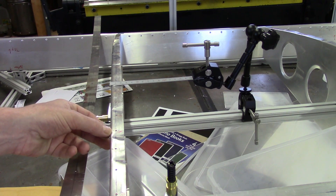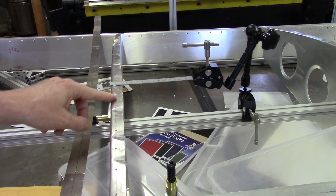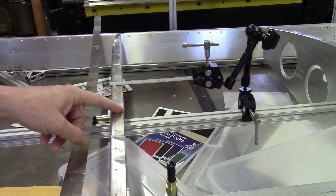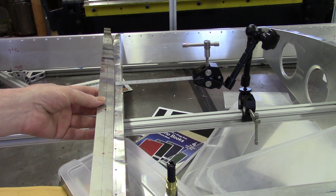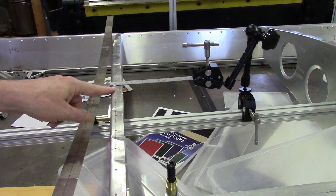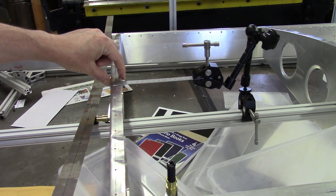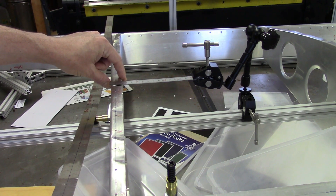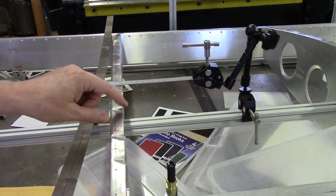I found that worked quite well — everything's pretty much dead on where I expected. I even knew of some places where I would have some deviation because, even in spite of trying to straighten these ribs out by adjusting the flutes after the ribs were fabricated, there's still a little bit of waviness. Of course, this gets you most of the way there, but then you can do a little bit of additional fine tuning. The other advantage of this clamping setup is to help ensure that the rib can't shift around while you're drilling in the holes, and I definitely had absolutely no problems with shifting.